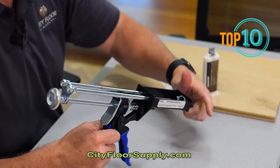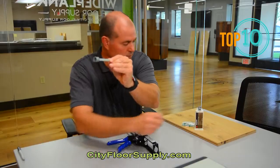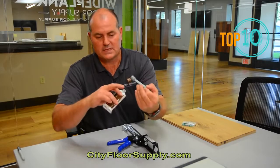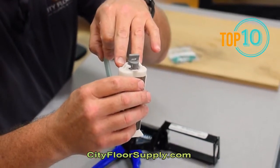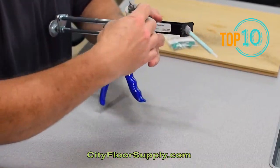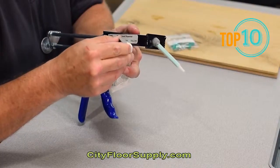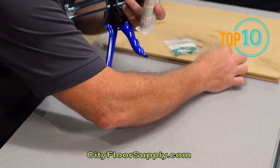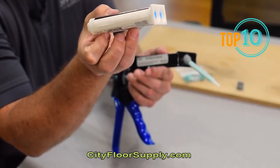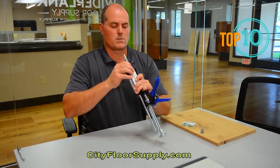It's a little bit awkward but not incredibly. Before we do that, let me show you this: there's a little triangle piece, and when I insert that there's a space for it in the DuoPack. When I line those up, the holes in the mixing nozzle and the two holes in the DuoPack will match up. So we put the mixing nozzle in first and let it hang out there. Then we take the tip off, twist that triangle to one side, put the rear portion of the DuoPack with the little pushers into the gun first. Once we're in, line up those triangles and twist it on. And that's it.